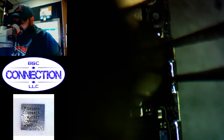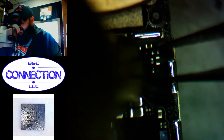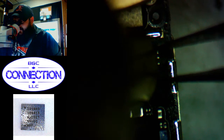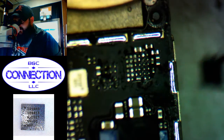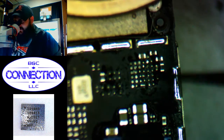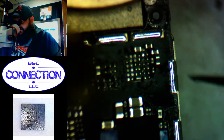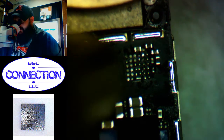Usually this process will create some cold solder joints when you remove it. You'll see some that are kind of flat on the top because you're pulling it pretty much at the exact moment that it's liquid. There we go — you can see you get cold joints through there on this edge. As they're touching, they melt instantly because they're right on the edge of melting anyway.